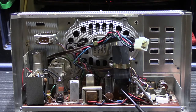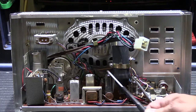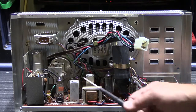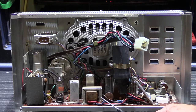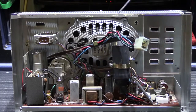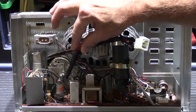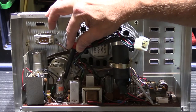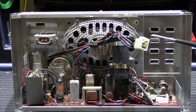Primarily what goes wrong with these sets is they're affected by age. This unit is 51 years old, and as well as it is designed, I don't think anyone at Nutone in 1964 imagined it would be in service for more than 50 years. Vacuum tubes generate a fair amount of heat, and that heat takes its toll on the circuit board everything is soldered to. A lot of what were called tubular capacitors in those days simply fail due to age.